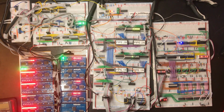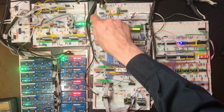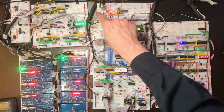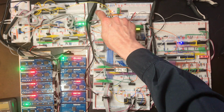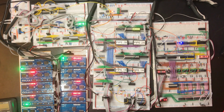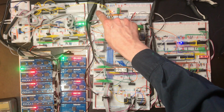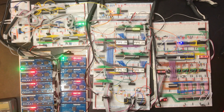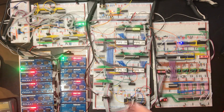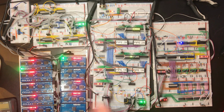That's getting a single step. It's the second time we've seen weird behaviour on this counter. I don't trust this counter board anymore. Yeah, the others are working fine and this one is responding badly. Okay, that's the same inverted clock line we're passing into the chip.